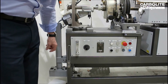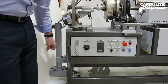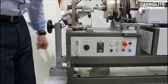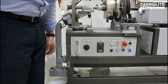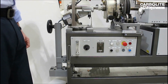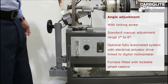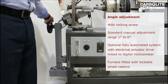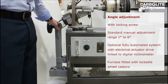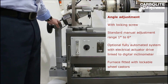The typical angle for the furnace is normally 2 degrees, but the range of the angle is from 1 to 6 degrees, with a rotational speed between 1 to 10 RPM. Control of the inclination is mechanical via the screw jack system. This is a standard option, but it can be replaced with an electrical actuator which can also be linked to the control system.